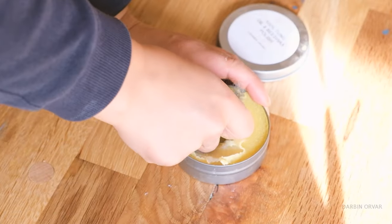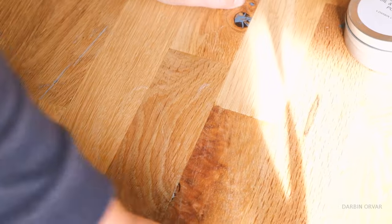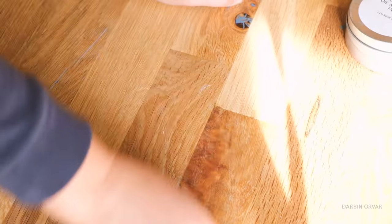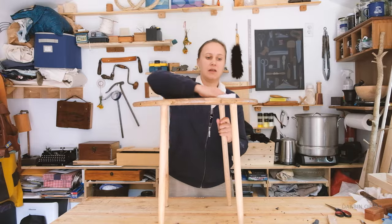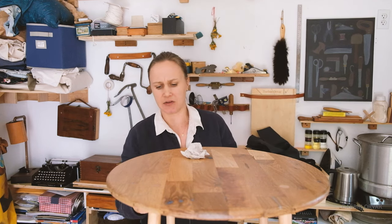I'm going to add some fine steel wool when I apply the wax polish, and that will smooth out any little bumps or imperfections even more and create that super smooth surface. After letting it sit for a minute, I'll just wipe off the excess. The top right now is super smooth - you can really feel the difference if you touch the legs. The legs have had two coats of finish and the top has had three coats plus wax polish. It's a completely different feel - matte, slightly very rich.